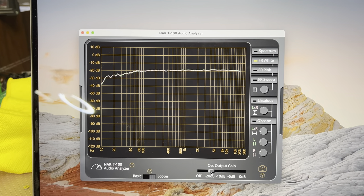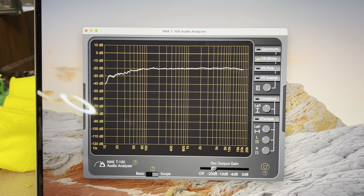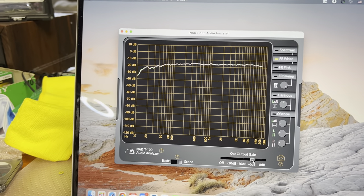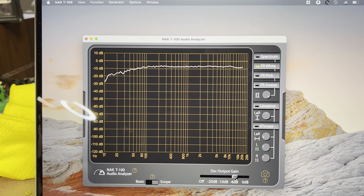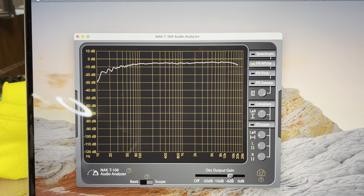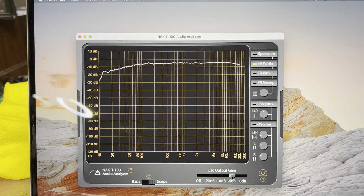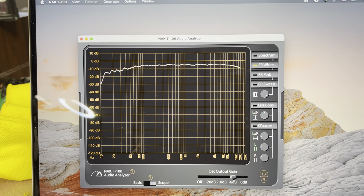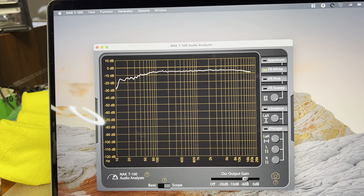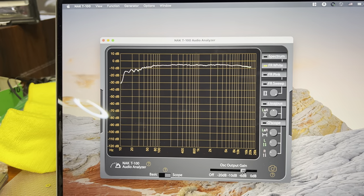Source — now tape — no change. Let's see minus 6 dB, if it's capable. Source at minus 6 dB, Type I tape — and tape: just a little bit of drop, like two decibels on the high frequencies. Wow, incredible. Results are pretty good.